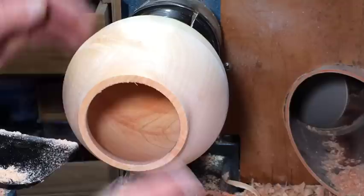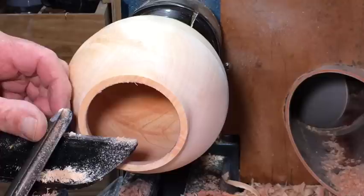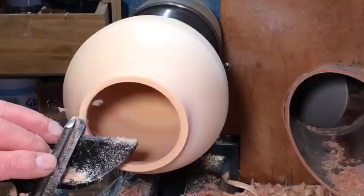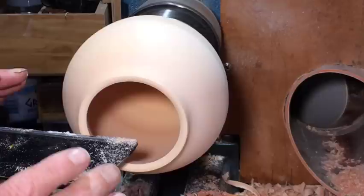So the next thing is to deal with that, and most of it could be sanded probably, but I'm going to go around. I usually use just to the right of the nose of the 3/8 bowl gouge. And it's just a question of easing the tool across very gently. Right, so that's fine. Now I can sand the inside at this stage, and then I do the outside